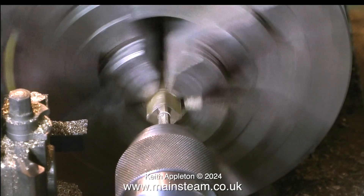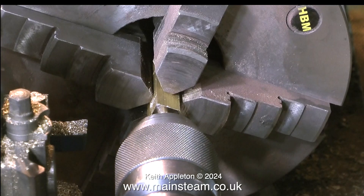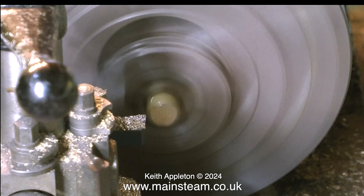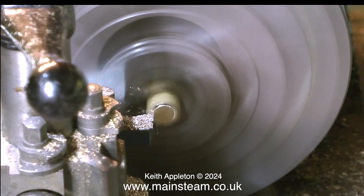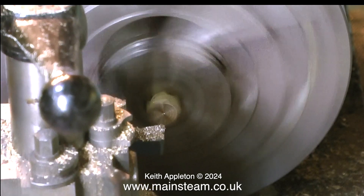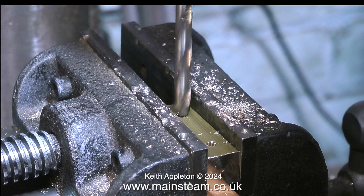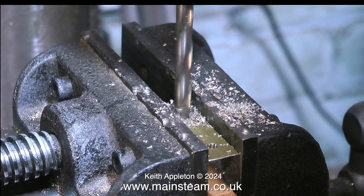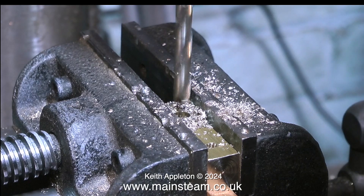Here I'm using a quarter by 40 threads-per-inch taper tap to thread the first 3/8ths of an inch of the hole to accept a union. I often use the lathe under power for tapping, running it at a slower speed. The final lathe job is to face across the end of the bar — the lathe is now running fast again. Some viewers will notice a small pip on the end of the work, meaning the centre height of the tool is slightly off, but this is not a high precision component and I'll be cleaning it up on the belt sander.